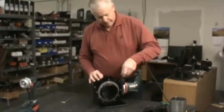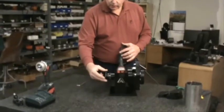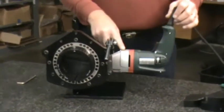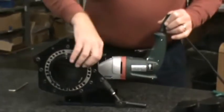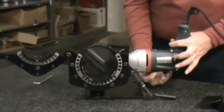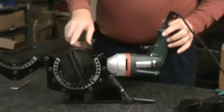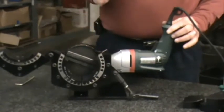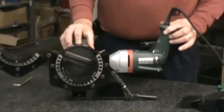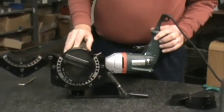The machine works with a clamp that goes down and clamps on. The cutting head is fed in with a knob. It is run by an electric motor that has a speed control, so you can adjust your speed to keep a constant speed, which is important when you're cutting stainless tubing because of what they call a work hardening condition. You want to run it as slow as possible and make sure it's always taking a chip when you're cutting.